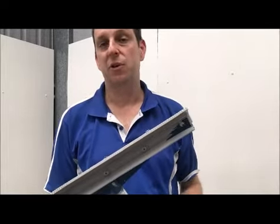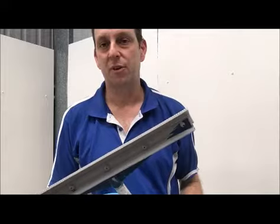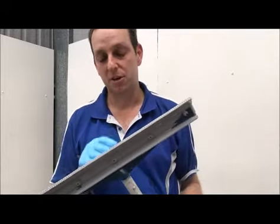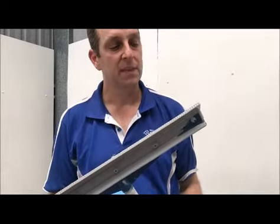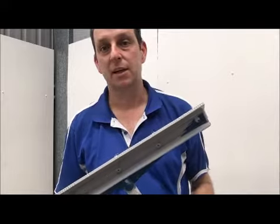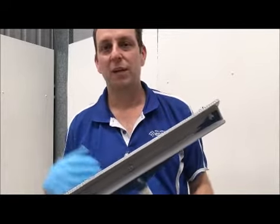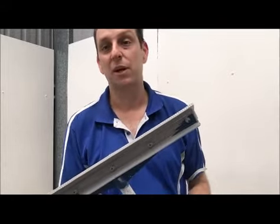And the last section of floor, which was about 25 square meters, had less non-slip in it. So it was a more even floor. And at that point, I saw the true benefit of this type of squeegee that's gauging it out at approximately the right thickness. You'll be able to see in the video that I've shot that it became very quick, very easy, no guessing, no recalculating, no rolling larger areas. And one of my challenges for today was I didn't want to get on the spike shoes.